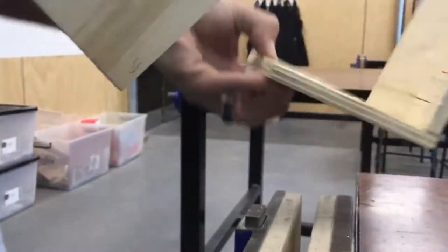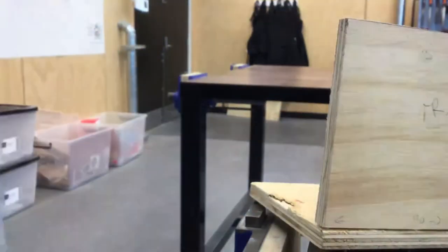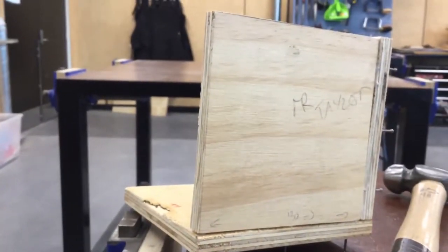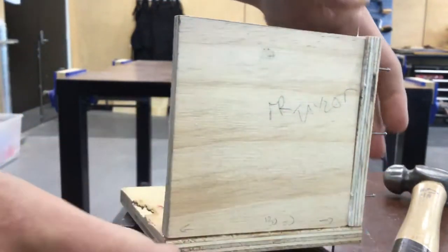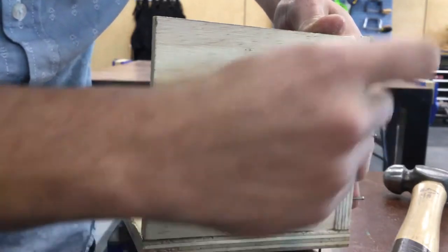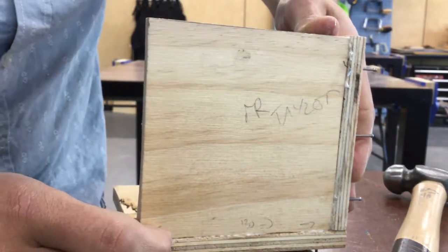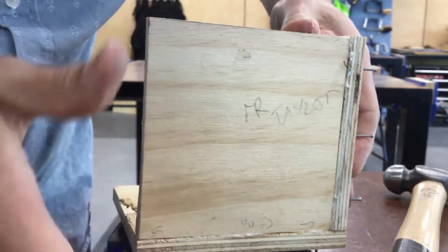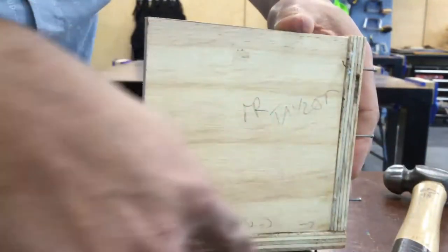With the wood all glued, it's time to put it together. Sit it in the spot you want it and look to make sure there are two kinds of alignment you need to get right. First, make sure the corner has the wood sitting in and behind both pieces — we're looking for it to be just slightly behind by a tiny bit, so we can file it down to perfect. If it starts in front, we can never achieve a smooth side. I'm going to nail this bottom side first and I can feel the lip the whole way along.